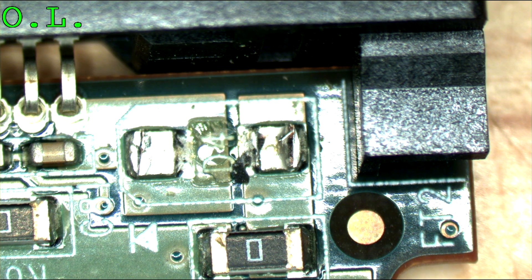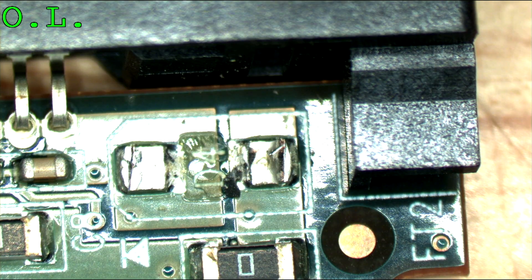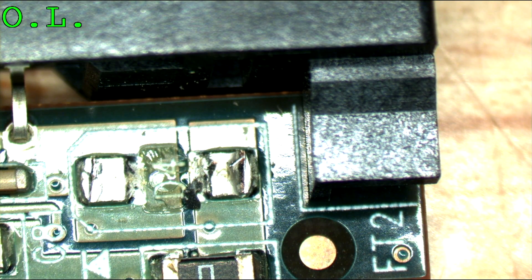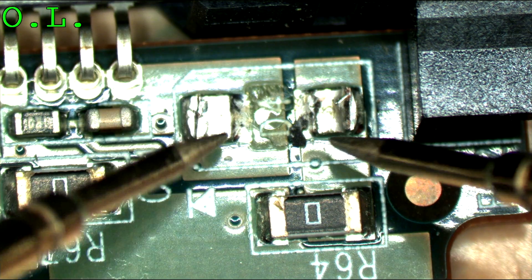After using the flush cutters to remove that 12-volt TVS diode, I'm going to measure the pads themselves. We get 1.59 volts one way and 0.555 the other — so this is good now. The way a TVS diode works is: when it's functional, it's basically an open circuit and doesn't interfere with the circuit. When it detects an overvoltage, it goes short circuit, clamps the voltage, and takes the voltage away from the load — that's what a TVS diode does.